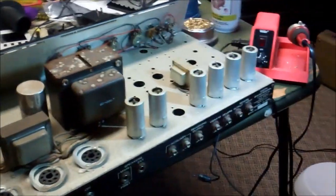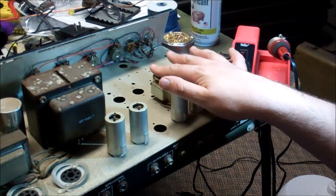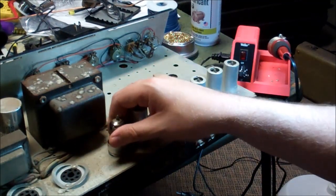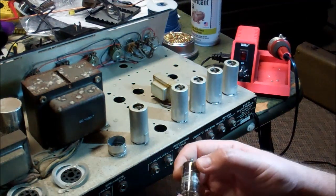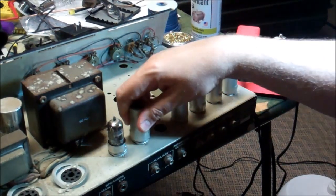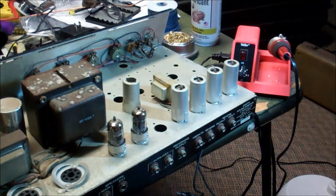Let's take a look at what we have on the preamp side. If this is following Fender-ish things, I should have four 12AX7s and two 12AT7s maybe. The sleeve came off — it's an ECC81, which is a 12AT7. And this one actually says IEC and Mullard on it. Even if this amp is a trash heap, if these tubes test golden and wonderful, they may well help finance fixing this amp. So that's another Mullard.